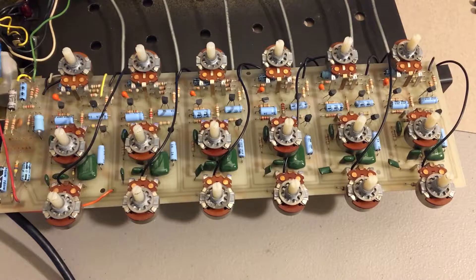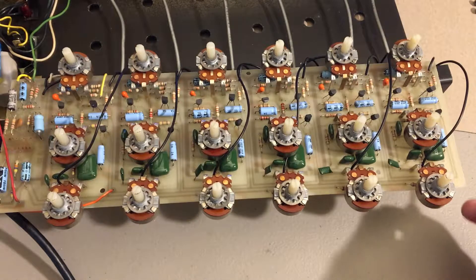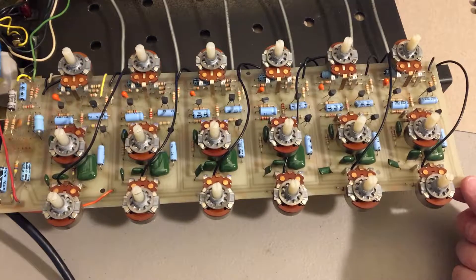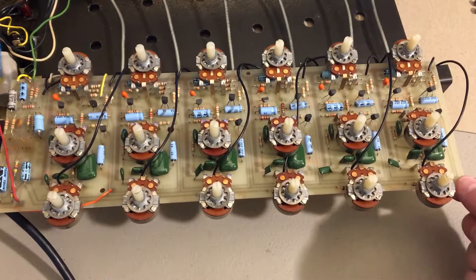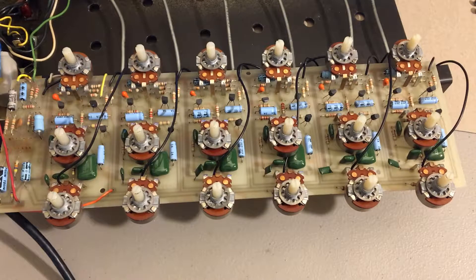I left the ground connected across so the chassis is all grounded, which helps keep the noise out. All in all they didn't sound too noisy when testing — it was a little louder with the cover off, but when I dropped the cover on and put a couple screws in, it got a lot quieter.